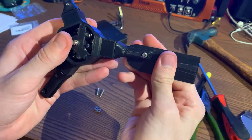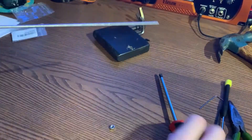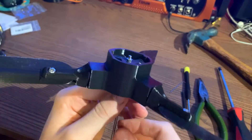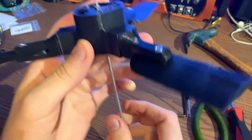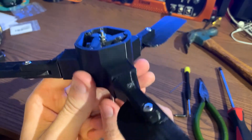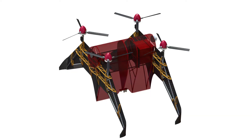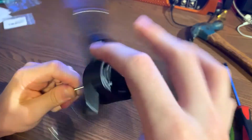The blades are free to lag, but tight enough that centrifugal force will pull them straight. And there we have it — the complete assembly minus the spinner. This is just the first prototype, just testing some of the mechanics to see how it works. You can see now we have blades pitching all together. This is going to be actuated somehow — my thought is maybe having this threaded rod spin through an additional thread that's fixed to the airframe, and that gives you really fine precision for your collective setting. This is intended to be used with the T-Motor U8 motor on a quad rotor platform with collective pitch. Thanks for checking this out — I hope to have more prototypes in the future and get this on a flying vehicle as soon as possible. Cheers.